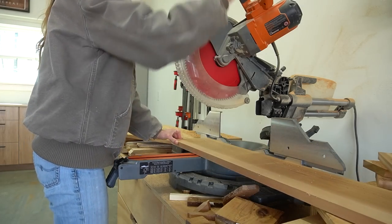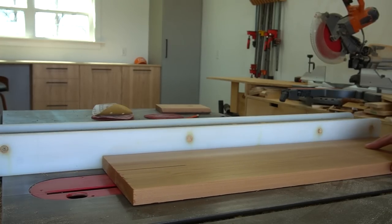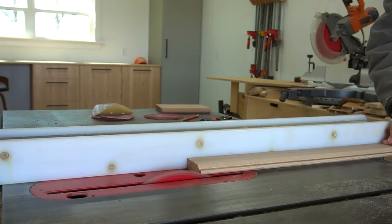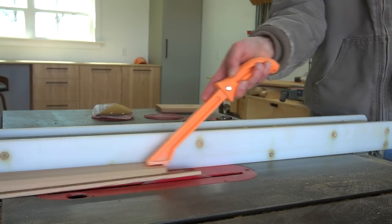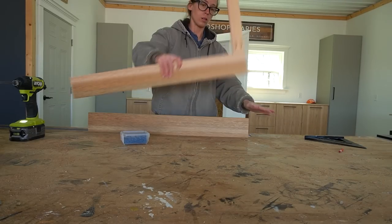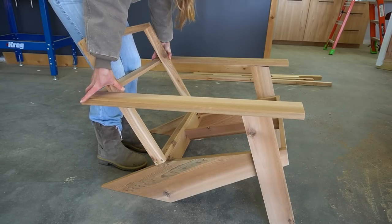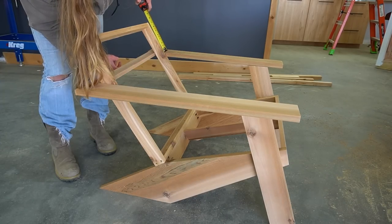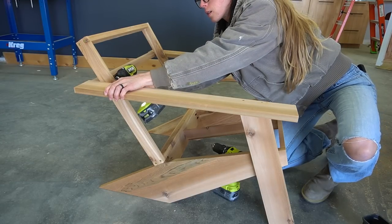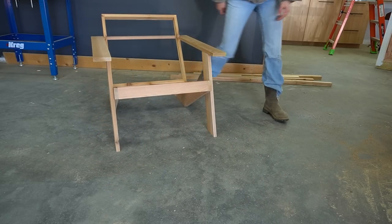Next up are the armrests. I brought the 1x8 board back out that I'd set aside after cutting the legs. The armrests are 30 inches long, so I trimmed the board to 30 inches and ripped it in half on the table saw — though a circular saw with a straight edge works just as well. I cut a 1x3 piece to attach them together at the back to make a U-shaped frame, ripping the tongue off my tongue-and-groove piece first. I assembled the U-shaped frame using pocket holes and screws, placed it onto the chair so the armrests sat flat on the front legs, and secured everything with exterior wood screws. A couple more screws through the inside of the back frame into each armrest really stiffened everything up — now it's ready for the slats.